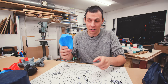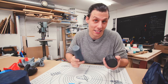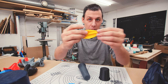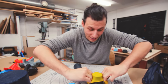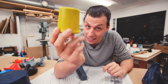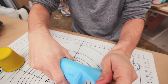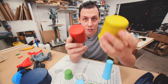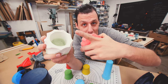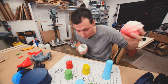I've got a really thin layer of mold release wax on all the molds. Now for the core pieces I have a cool trick I also used in the last video. You can cover them in mold release wax, but they have a tendency to be a little hard to pull out, especially the two smaller ones. So I take a balloon, cut off the neck, and stretch it along the edge of the core — this thin layer of balloon acts as a perfect mold release, making it really easy to remove. You only need to do this with the two smaller ones; the big one is easy enough with just wax. I've also modified the original small planter mold — the opening is a bit bigger so you can have a bigger plant and it takes a little less material.